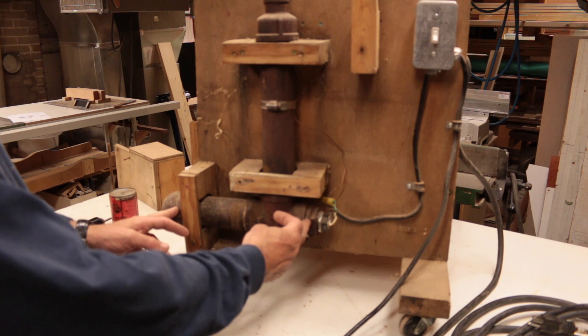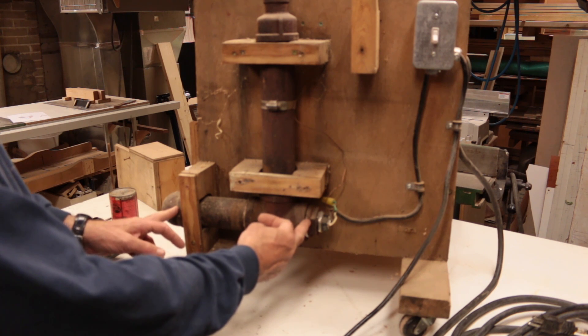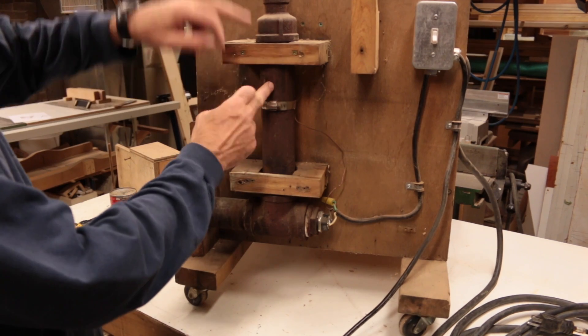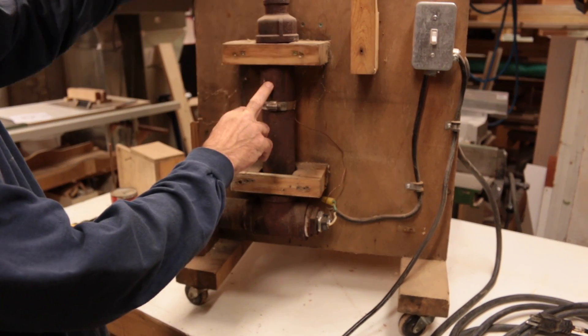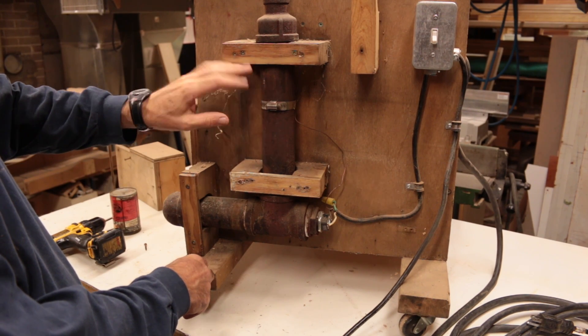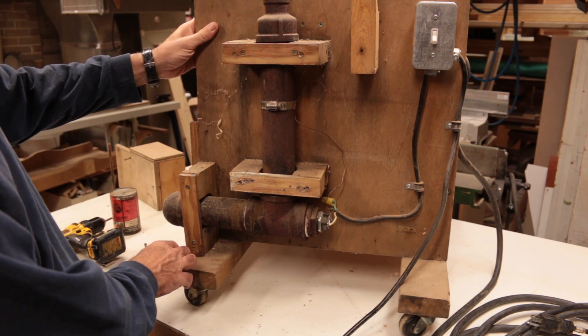So mounting horizontally was a simple way to make sure it stays immersed. I also found when it was running vertically, you had to have a good amount of pipe to keep water from boiling out the top. And if you have too much water in your reservoir, it will still tend to boil out to a certain degree.